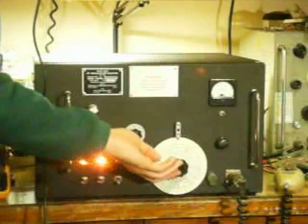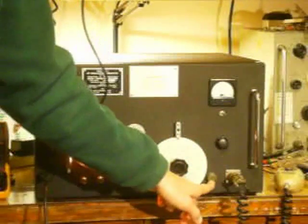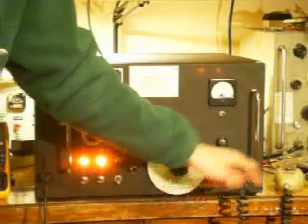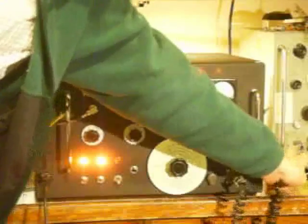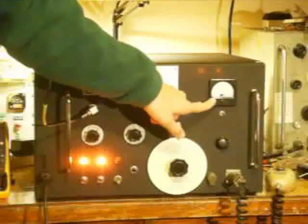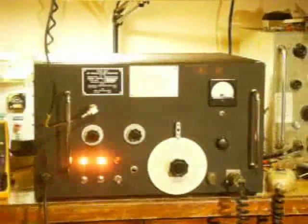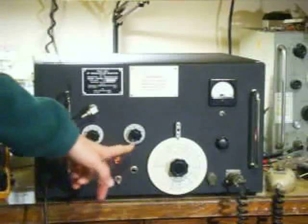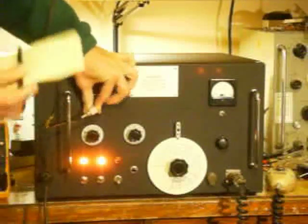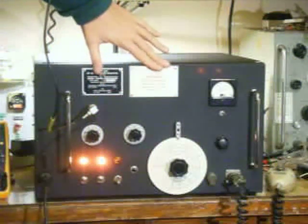There's quite a bit of QRM right now. Moving this way, this is the headphone jack, this is the microphone, which is an old Motorola police microphone. And up here we see the signal meter, which also doubles as the transmit RF voltage meter. And coming across the radio this way, we see the RF gain control, the drive level, and the antenna connection.